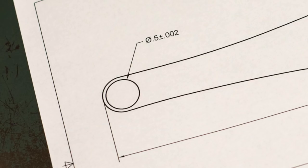So let's say we want a knife to be ten inches long. Tolerance is the amount of wiggle room we have in hitting that nominal dimension. We're aiming for ten inches, but how much room are we willing to go plus or minus and still feel like we're hitting our mark? The tolerance for the length of a blade might be an eighth of an inch or several millimeters. Whereas the tolerance for something much thinner — say the thickness of a blade or handle — is going to be much, much tighter. When engineers and machinists talk about tolerances, you might see on a drawing something like: specified diameter of half an inch with a tolerance of plus or minus two thousandths of an inch.